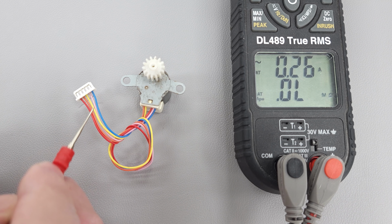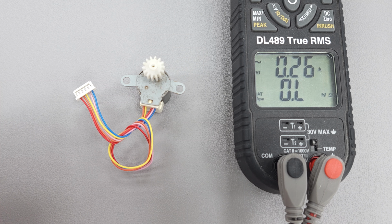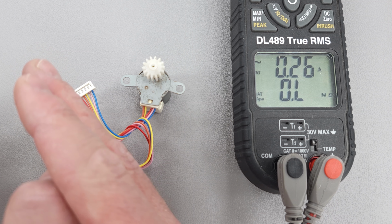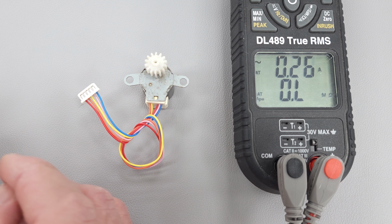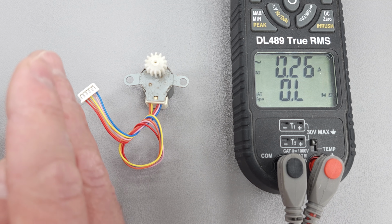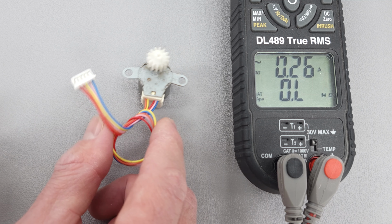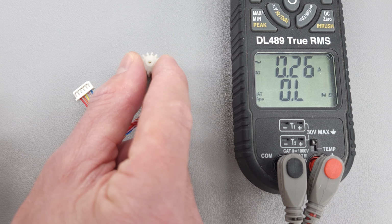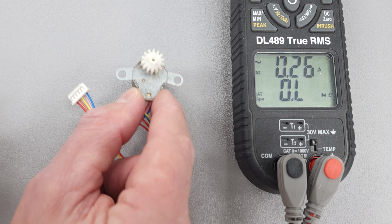Now, some of these louver motors may have two or three of the coils intact. And what'll happen is when you see the louver motors opening or closing, you'll see more of a jumping effect. It's not going to be very noticeable, but it is noticeable. And that louver motor is potentially on its way out. It's getting overheated, maybe due to the friction or something like that when it's trying to turn. And so that could be an issue.